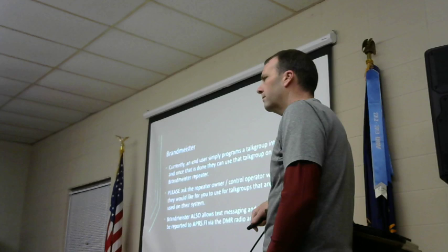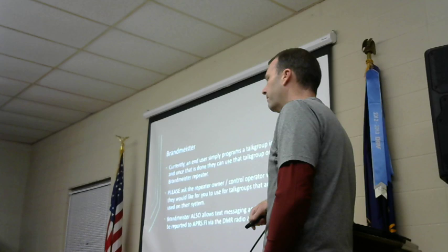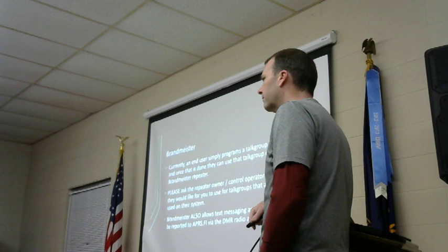I think probably one of the biggest things is, back when Brandmeister really started getting into the talk group 3100 and 310, everybody gets on there. And if your repeater is tied to the whole group, you've tied up your repeater. And I think Chuck has even said they've had a few repeaters just burnt up because they've been on continuously and never had a chance to rest. So having the hotspot allows you to key in on that particular talk group without tying up your repeater.